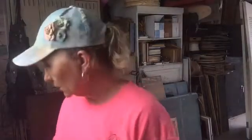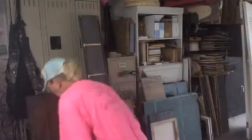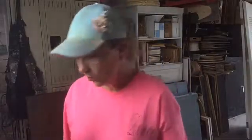But first thing I do whenever I'm starting a piece is I will lightly sand it, and I always use my orbital sander, and I use 220. I like the orbital because if you use those that are triangled, a lot of times they'll leave squiggly marks. So this is the best to use, and this is a Craftsman, and you can set it different settings. It's slow to really fast, and I usually keep it on about a 3 or a 4.